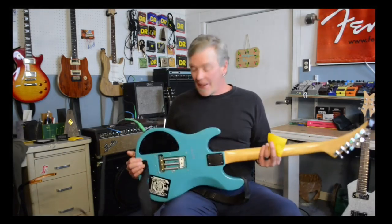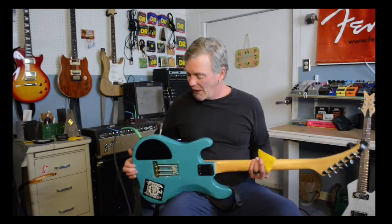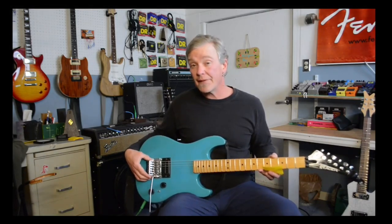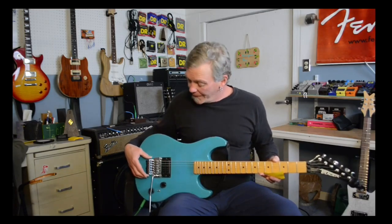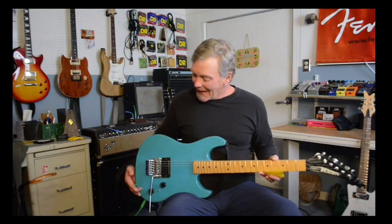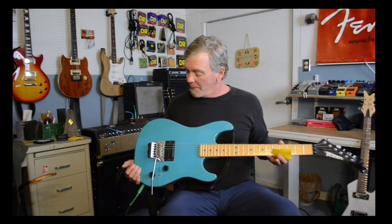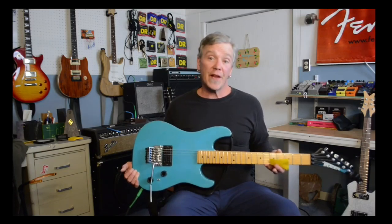You have to examine how the block is looking inside the cavity. You have to make sure your tolerances are there. I thought I had to shave a tiny bit of material, but when I finally got it in perfect position, I didn't even need to do that. I spent a lot of time lining this up before I drilled my holes, and it lined up beautifully, and it covered up the existing screw holes, which is another thing that's nice to have.